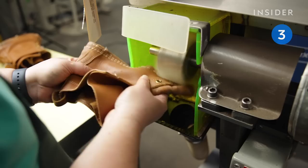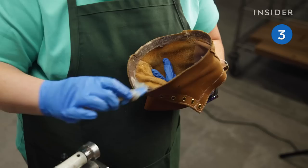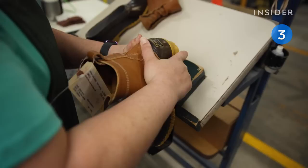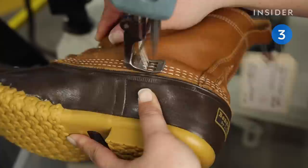The remaining stitches are individually plucked off the uppers by hand. A rub machine with rotating bristles loosens the stitches and makes the work easier. With the stitches removed, the boots can be reassembled. Cement is applied to the boot's new sole and the upper, then the soles and uppers are attached. To finish, a vamping machine drops three rows of stitches to secure the uppers to the sole.